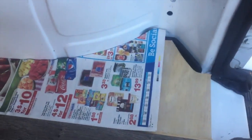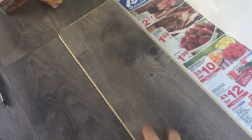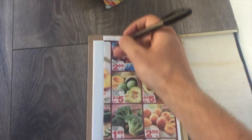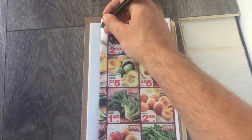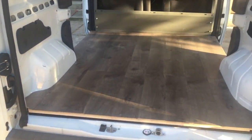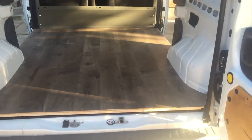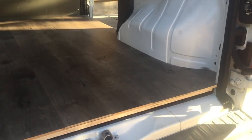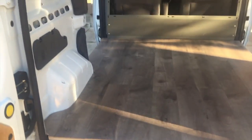That gives me a line right there. I cut it and that's how it looks when I'm done. Now I have a plank pre-cut, I flip it over, then flip the template over and just take a pencil to mark where I'm going to saw it. I used a few black screws to secure the plank flooring into the foundation flooring beneath it. It's precision cut and heavy so it's not going to move around at all.